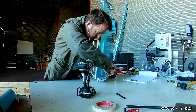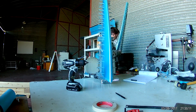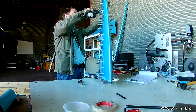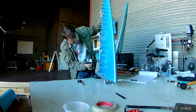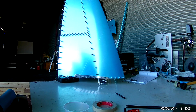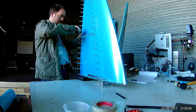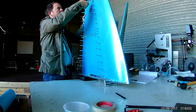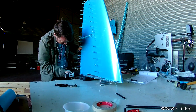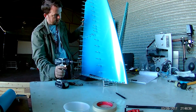There are a couple of match-drill holes that you need to make through the skins into the ribs. Once that's done, now we get to final drill all of the 3/32nd or number 40 holes that correspond to both the skin and the frame underneath. It's drill, drill, drill, drill, drill. What I do is put a Cleco in every other hole, or roughly every other hole, then move all the Clecos and drill out the rest of the holes.